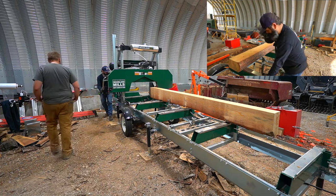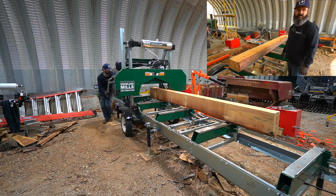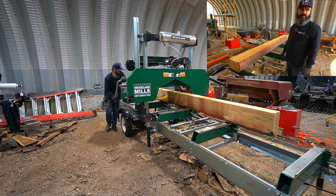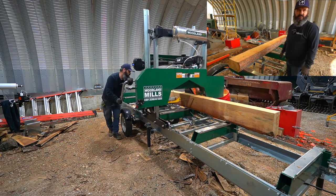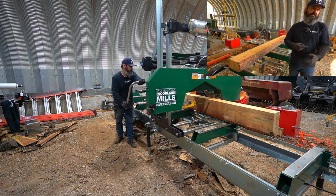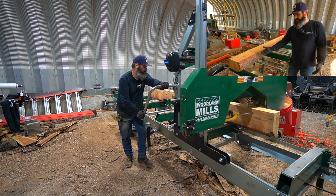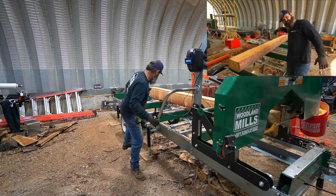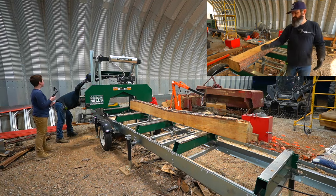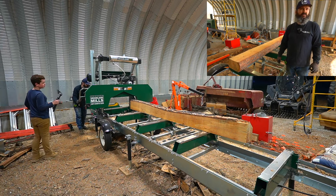What I like about the method you're using is that by getting that to 5 1/2, when you slice your 2 inches off of it, you know what they are. Yep. I take the cant the side as big as I can get it, and then my 2x are as wide as I can get them. They're not exact, they're not 2x6. Then you have to process them further. 2x5, 2x9. Yep, I get a variety. Then you're stuck stacking them up on the mill, trying to rip off the edge. If you have a straight line rip machine, you could cut them off. That's what you do with live edge stuff. Paul Case has an edger that he can do that with, and we don't.